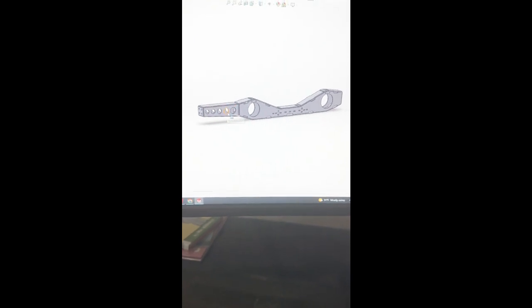Little bolt pattern on the sides here. This will actually not span all the way through. It will with these little side extensions. The idea is eventually I'll take these side extensions off and there'll be a stiffener that runs forward and back in the car, and it'll attach to here too. And then they'll just make a little shorter side extension to remount to the original transmission mount.